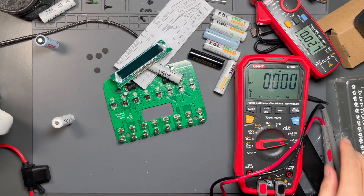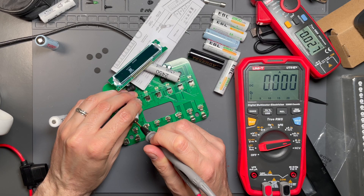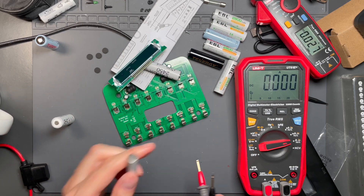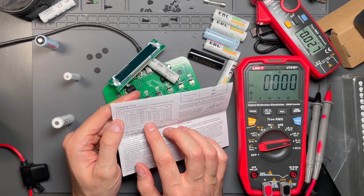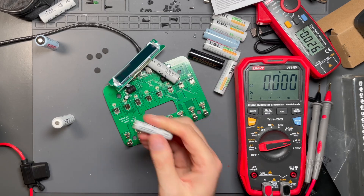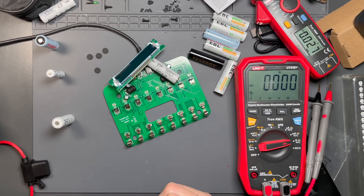One last test: putting a AAA cell in and measuring off the AAA pad. It is doing about one amp, but at a much slower duty cycle — coming in at 0.6, 0.4, 0.9, 0.5, 0.6, 0.9 — hitting one amp every so often. I prefer to see it current limited to what it claims: 250 milliamp for AAAs and 500 milliamp for AAs. It's not hitting 2 or 2.2 amps like the old Power Owl. I've charged many AAA cells in here and they have not gotten hot.